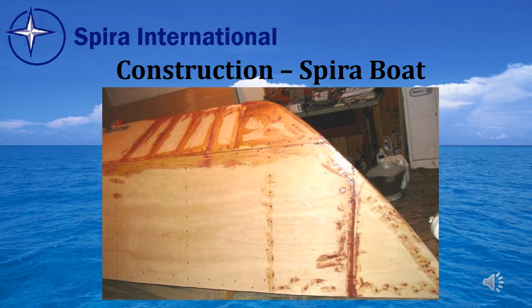As you approach the bow in V-bottom boats, the plywood doesn't twist very well to accommodate the amount of twist in the hull. In this case, you can cut the ply into smaller chunks and fit it together up there. It'll then be able to be sanded smooth and create that nice V entry.